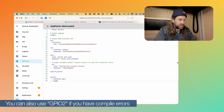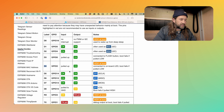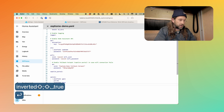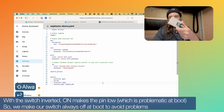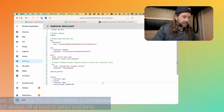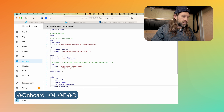Scrolling down, we'll find a best practices chart that tells you which GPIO pins are best to use and notes about ones to look out for. What I'm looking for is how to control the onboard LED. Looking at D4, which is GPIO2, I can see this is connected to the onboard LED. So I want to use pin D4. Something I noticed while looking at this chart: one, it says this pin is pulled up, so it's inverted from normal logic — it's high by default and high at boot, and the boot will fail if it's pulled low. So there are two things we need to do. First, tell it to be inverted — 'inverted: true.' Second, change the restore mode to 'always off,' which means anytime this device is powered up or rebooted, our switch will be off by default. Finally, we give our switch the name 'onboard LED.'